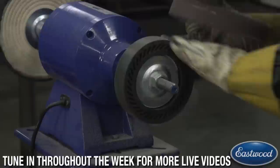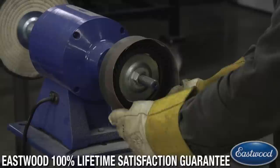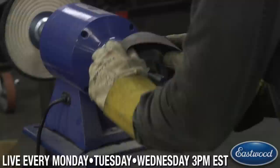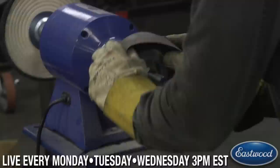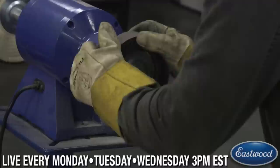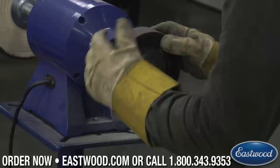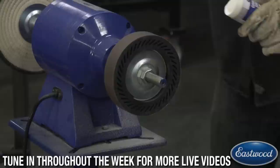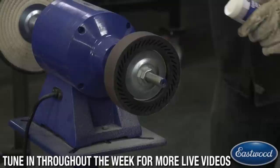Let me show you guys putting the wheel on since we didn't show that yet. Because the expander wheel does expand, when the motor is off we can fit this band on a little easier. You can work the edge and push on it — some bands are a little tighter than others, but they'll all be a snug fit. You may have to work it, but just make sure it's fairly centered and all the black of the expander wheel is covered. Now I'm putting a little grinder's grease on this 120 grit band before we keep working the aluminum piece.